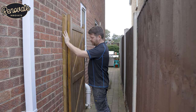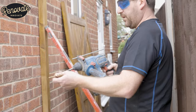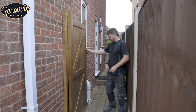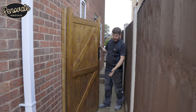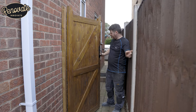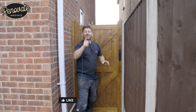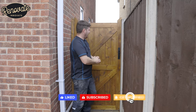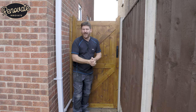We fixed the post on using those fixings that we showed you — very simple to do — and then we used the big T hinges. We'd already got the latch on, simply a case of lifting the gate off the ground, secured the hinges, and then put the latch on. We had to make up a little something here to get the latch to work, put the customer's bolt back on, and that's it, finished. So that was our how-to hang a gate. Don't forget to watch part one of this little series of how we built the gate. We hope you enjoyed this video — if you have, please like, share, subscribe, and we'll see you on the next one. Thanks!